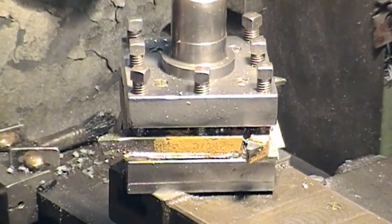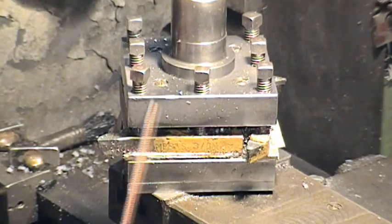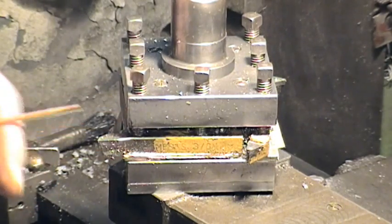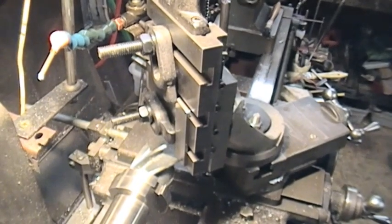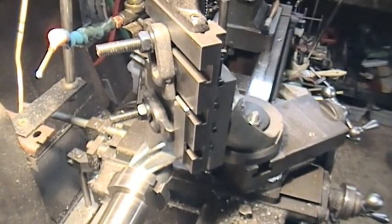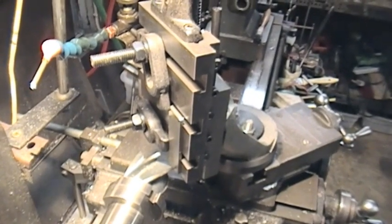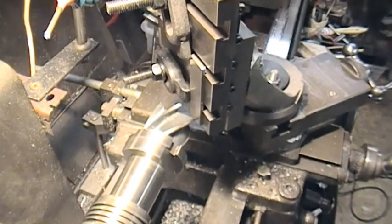Just a reminder of my rather basic four-way tool post. The two and a half inches I referred to is the dimension from one point to the other, which includes two tightening screws. The depth from that point to the inner is a half inch. This is what I'm going to call a down and dirty quick fix. The piece of material is two and a half inches by three-quarter by an eighth. Down there is the shell end mill in the spindle, ready to go.